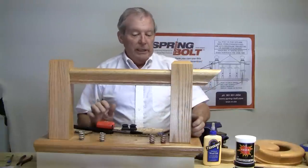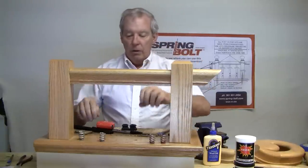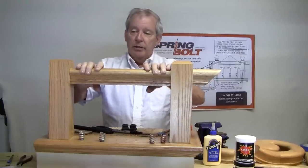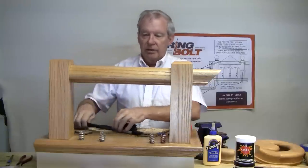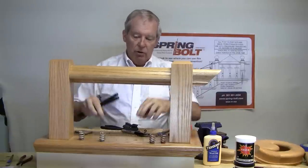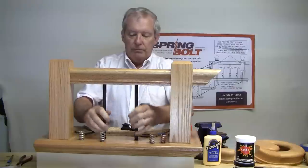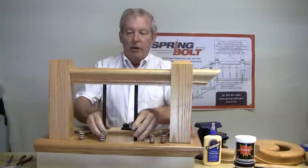If you get out to a three and a half inch or four inch post or bigger, you're not going to have to worry about that at all. You can put a little epoxy on here if you like, or not. Once you put your balusters in, you can twist the rail either before the epoxy on the post is set or after. You can do this the next day if you like, after the epoxy is set on the post — just twist the rail, put your balusters in, and swing them in and down.